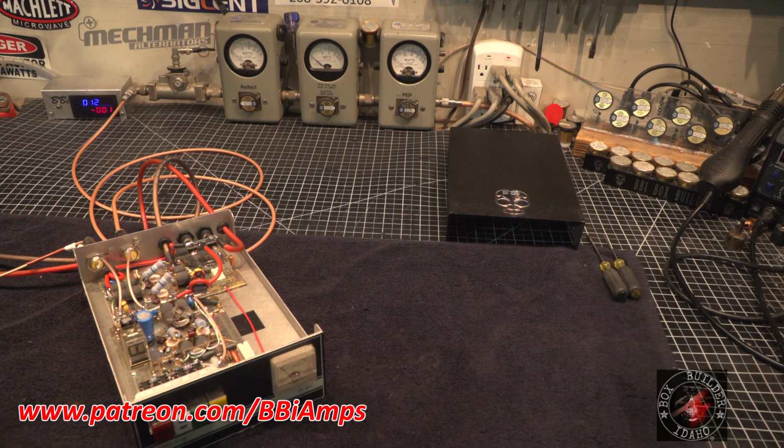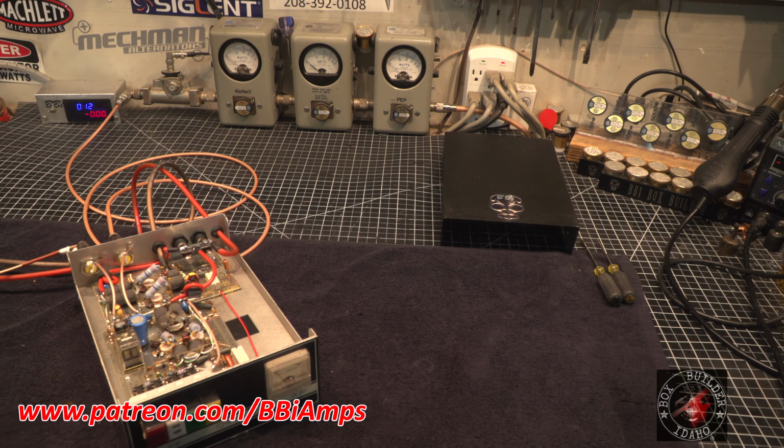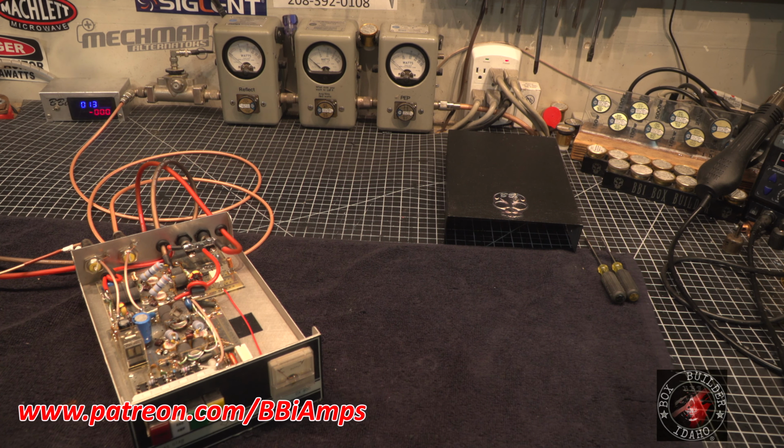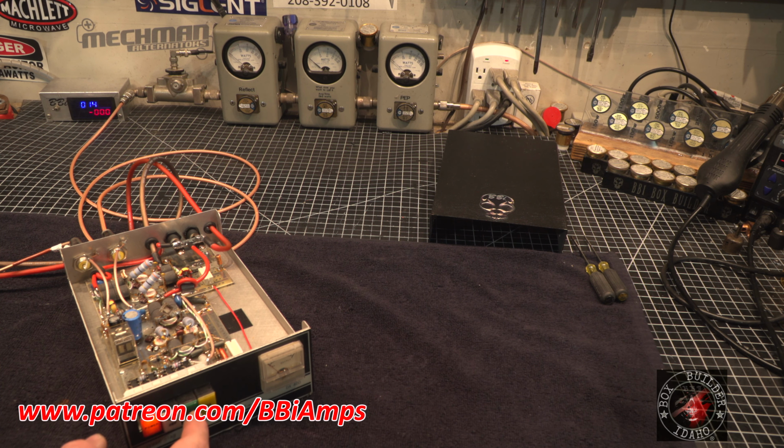Okay. So let's run it through its paces. Let's turn it up on volts and let's max it out. Give it a couple seconds for the power supply to charge up the batteries and charge up the super caps. And we're going to stop at 14.9. We're there. So amplifier on. So just short of 600 watts out of this Texas Star 400.